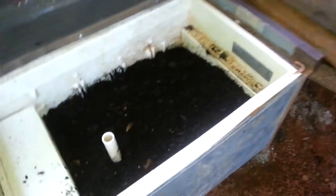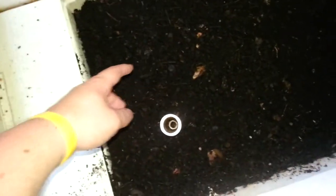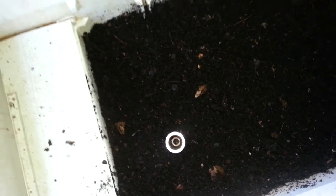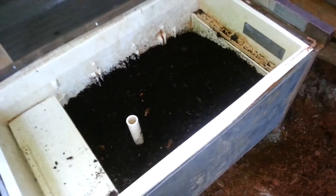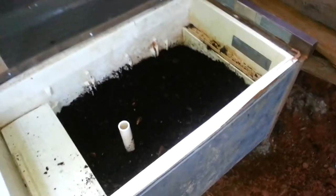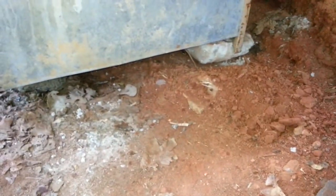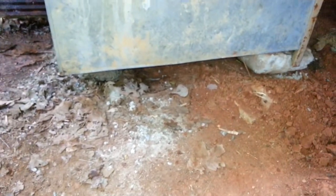You can see down in here I got my white pipe, and another little white pipe — got holes drilled in it so the water can drain down. Got the bigger pipe over it, put some rocks down in the bottom to help let the water drain off. Got it propped up and draining downhill.